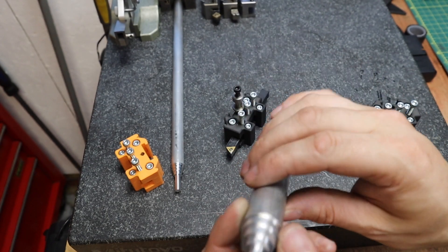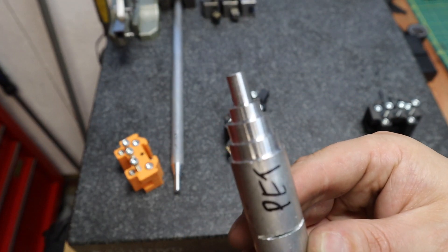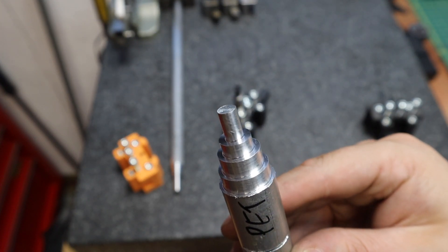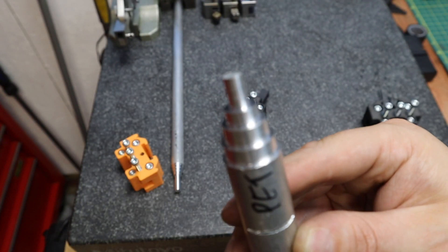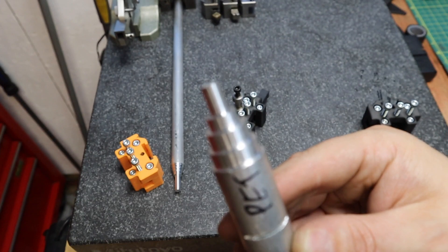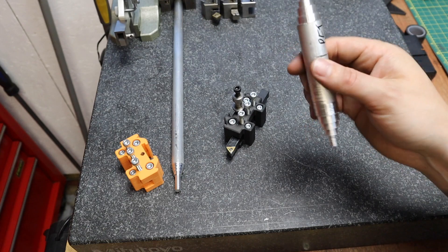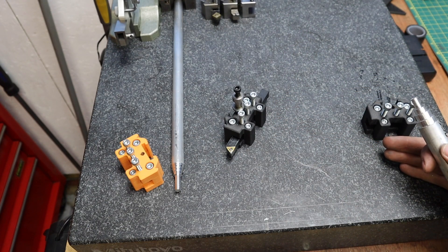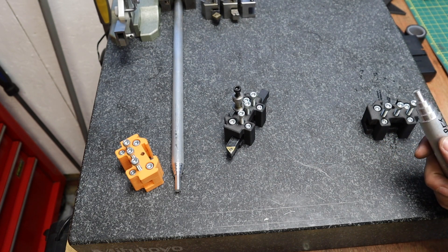Also, the PET CF - for me, this one gave the best surface finish. Granted, we couldn't quite take as much depth of cut as with the nylon CF, but the finish on that is really good. So if all you're doing is soft material like brass, aluminium, or plastics, I think these tool holders are something that maybe all of you should consider printing. It's going to be a really cheap alternative and you can have them the same day if you've got a 3D printer.